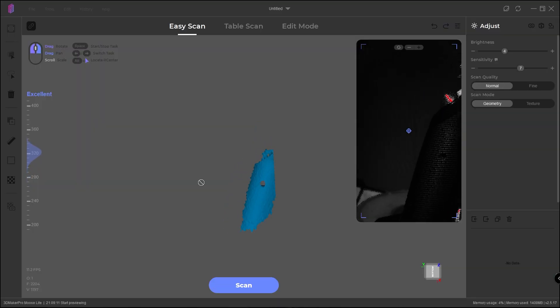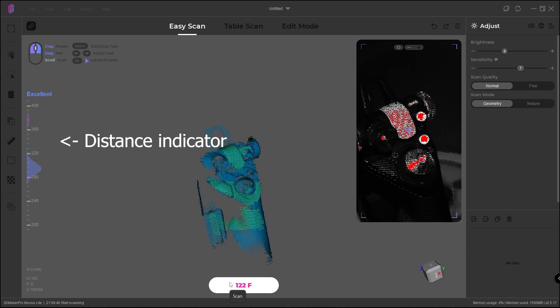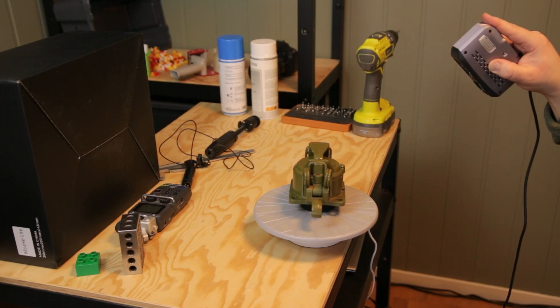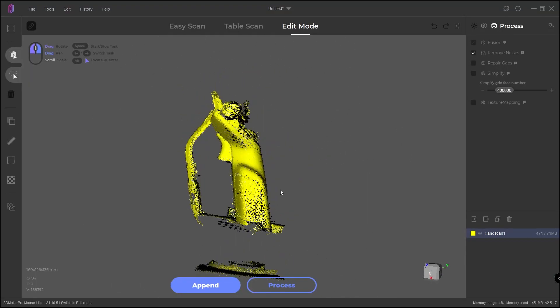The other way to scan is the handle mode. You again set the brightness and exposure for the object, and then you're off. You have to do a lot of work keeping the scanner at the right distance — there's a fairly narrow scanning window and a fairly small area, so all movements have to be coordinated. This is natural for me after 10 years of scanning, but for many new people it's very difficult to look at the screen and move the hand accordingly. Practice is needed. If you're on location, make sure you get a few good scans before packing everything down and driving home, only to find you missed something.